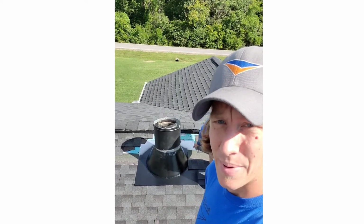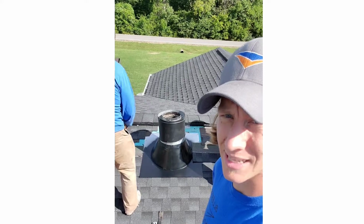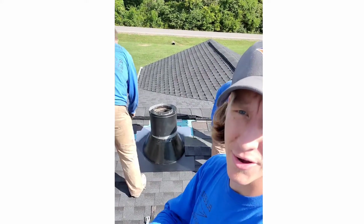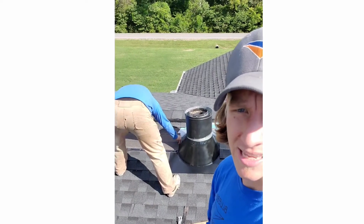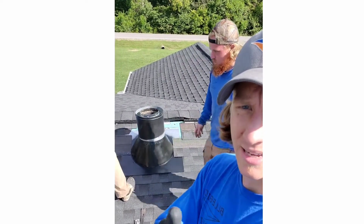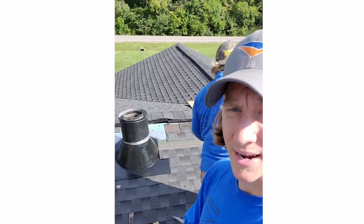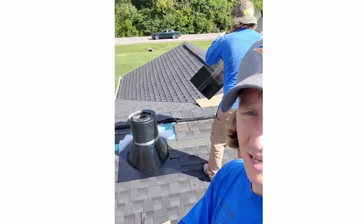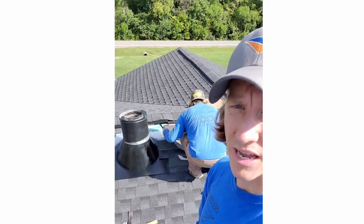Today we've got some base flashing that we're replacing because the old one was leaking. The bigger these are, the harder they fall, and that was definitely the case here. The mistake that was made is not exposing enough of that metal on the bottom side. So we ran actually 2 courses to get that shingle breaking at the center or right below the center.